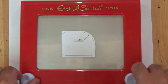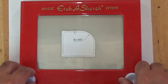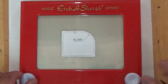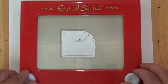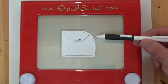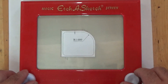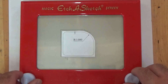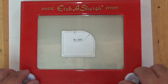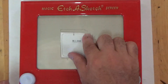So here's the tool, and I'm going to machine around the part — climb mill my way around it. And then when I come to the arc, I'll stop right at the tangency of the arc in that line. And then I'm just going to move a little bit in X, and then move Y down until I just touch the arc — just kiss it. I'm going to put the arc on radar so I know when the tool is just touching it. So I move delta X, then a little bit in Y until I just kiss the arc. Delta X, move Y down until I just kiss the arc. And so on until I've done the whole thing. And it's going to be the same thing, except with much finer increments.